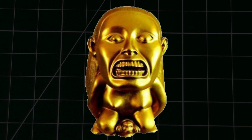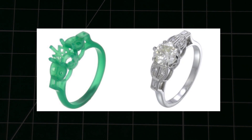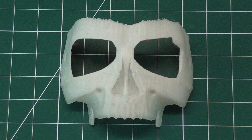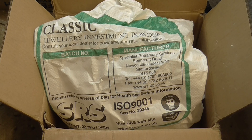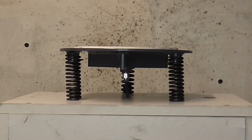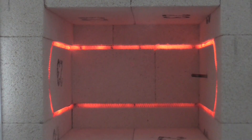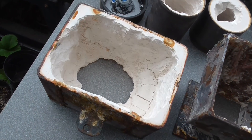The pattern is destroyed in the process so can only be used once. This is how statues and jewellery are made. Traditionally wax is used for the investment pattern, but PLA plastic, as used in 3D printers, also works well. The process is more complicated and needs some special equipment. Sand doesn't work well so investment casting plaster has to be used. I also had to build some special equipment to do this: a vacuum degassing and casting pump, and a burnout kiln that can reach the temperatures needed according to a set timing schedule. I also had to make a variety of flasks to hold the individually shaped patterns.